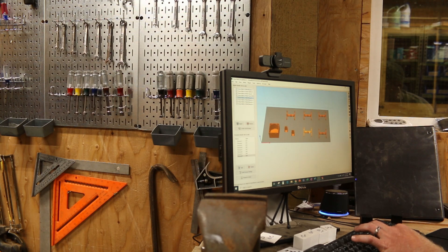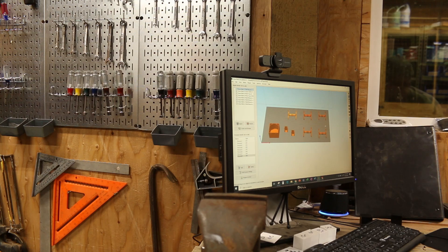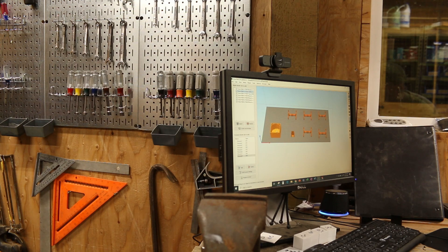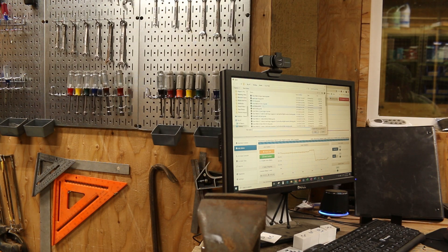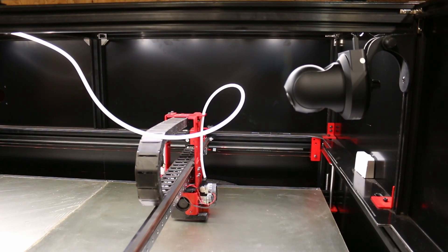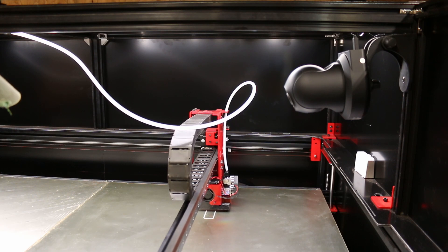When you're placing them doing multi-process like what I'm doing, you start over here and work your way in a zigzag so that you don't break any of the models you've already created and don't have the nozzle hit those models. Prepare print, select them all. It's going to be a big one — 51 hours. One, two, three, four, five, six — all right. Save it, load it, go for it. There goes the print — we are going again! Looking nice, looking really nice.